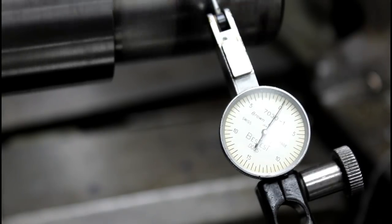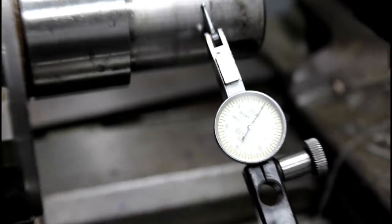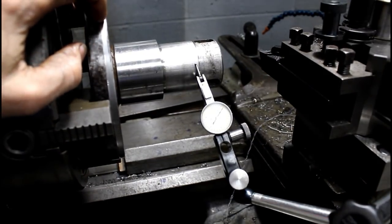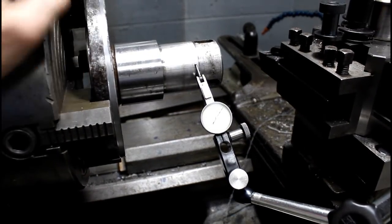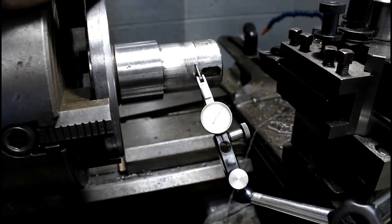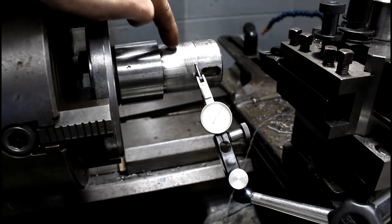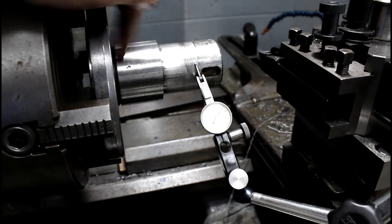And we're just a little bouncy out there. So I'm fairly happy that the shaft is straight in the lathe. I'm glad I turned in that reference ring. That saved me some headache. Sometimes your plans change during the job, because you start putting in centers and stuff and you can introduce error that otherwise is unneeded. So I think that this job's went well so far. Hopefully I don't shaft myself by saying that, but all we got to do is turn this down.